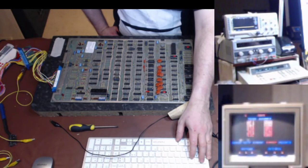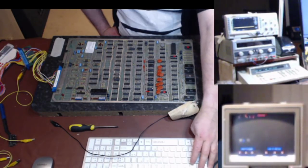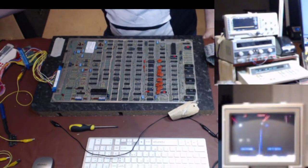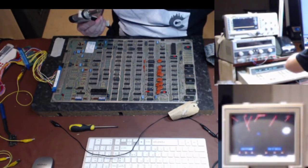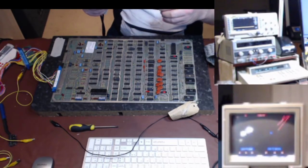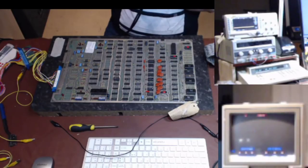This particular customer, I've also said that I'll do some further destruction testing on our machine at work, so I'll take this in with me tomorrow. One thing I'm going to do is clean the desoldering tip. Here's a quick tip if you've got one of these: before you shut it down at night, grab the reamer, stick it down the nozzle, squeeze it, grab some solder.